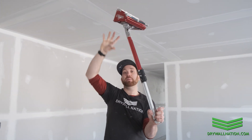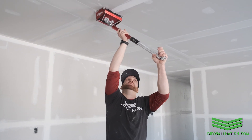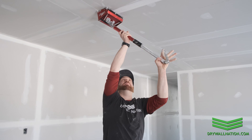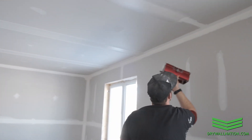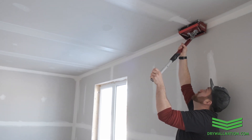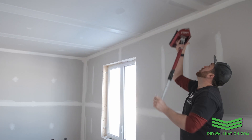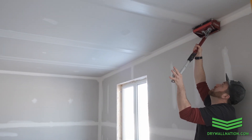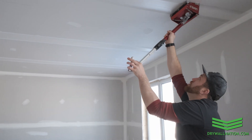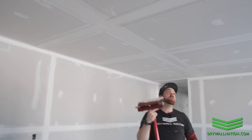When you go to put it to the ceiling, that's when you transition to the brake. You let go of the top hand, hold the brake in place, and once the box is to the ceiling you can let go of the brake and start to roll freely. Then you pinch the brake again just a few inches before you're ready to pull off — roll away and then as you get towards the end of the seam, pinch the brake and pull off.